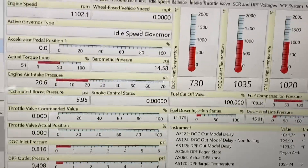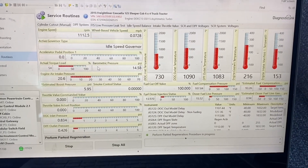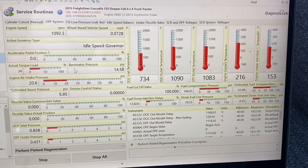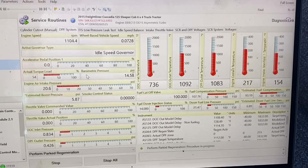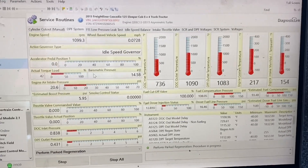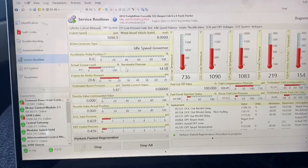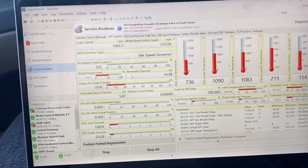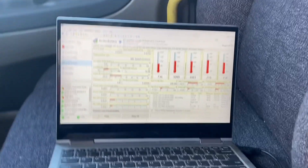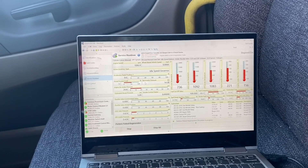Right now temperatures are good. Just a little peek behind the curtains — we are about 30 minutes into the regen. Temperatures are consistent; they are not spiking like they did at first. DOC inlet, 734. DOC outlet, 1,000, almost 1,100 — pretty normal. DPF outlet, right on the money. I feel pretty good about this. 30 minutes in — do not stop it, do not abort it. You have to confirm what you're doing. This is why this stuff takes so long, especially in a shop — it's not something where you can just plug in, clear the code, and go. You've got to do a regen, let it cool off, then do a regen again. This fault code, it looks like everything is good.